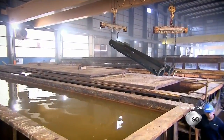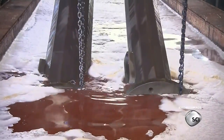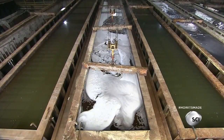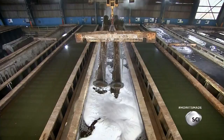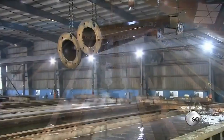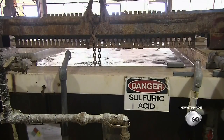The factory ships the finished poles to a galvanizing plant, where they're dipped in a series of wash tanks. The plant's tanks are deep enough to fully submerge the poles, so they can treat both the inner and outer surface at the same time. Now, the poles go into a vat of sulfuric acid. This bath dissolves the more stubborn contaminants that washing can't remove.